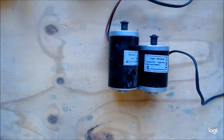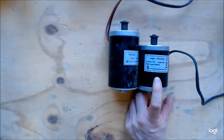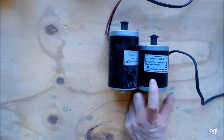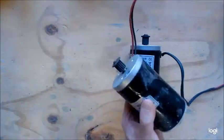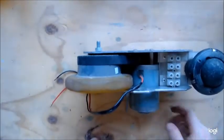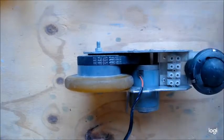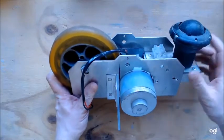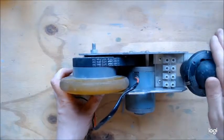Initially with my R2 I used a 12-volt 100-watt motor. I found when driving on thick carpet, I had problems — I needed to give it almost maximum power to take off, and once at maximum power it shot off. So I upgraded to a 24-volt, 150-watt motor. As you can see, this is quite big, and when you've got the foot shell, space starts to get tight. Here is my R2 foot shell — motor here, and an omni-ball at the front. These days I would use a Vex Omni wheel at the front instead; they're a lot better, though a bit noisy — better than the old ones which pick up all types of rubbish.